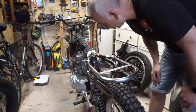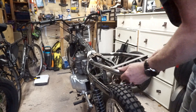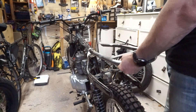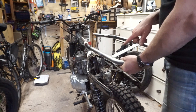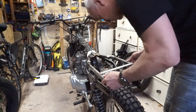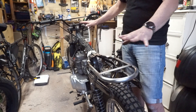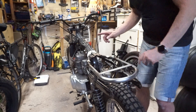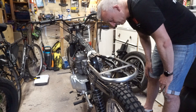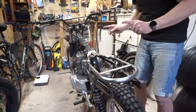We've just loosely tacked together — it's not attached to the frame in any way, but that is now one removable component with the uprights and the bracket across the top. I need to work out how I can drill and attach the seat. Once I've got the seat on, drilled the holes, and it all sits perfectly, I'm going to dress back the frame, make sure there's no paint, and then tack it in place.